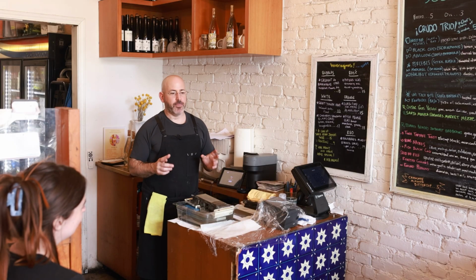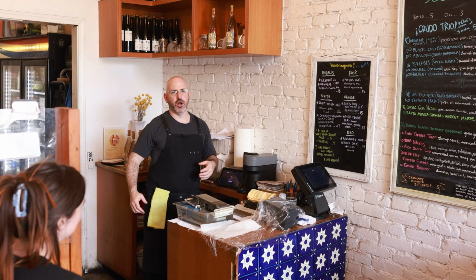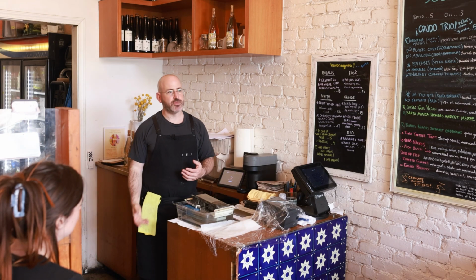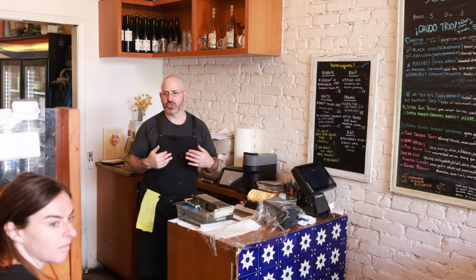All right, so I'm going to flip over to magnesia stones because they are almost the polar opposite in every way. Magnesia-based stones are set at room temperature. There's no oven firing in them at all, and they are not porous. That means that they do not absorb water. So when you use them, you can just splash water on them and start sharpening, which is really, really convenient. However, they cannot be soaked. Soaking them will cause them to kind of disintegrate and fall apart.